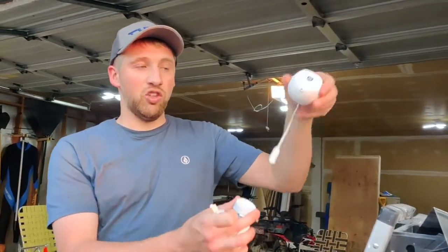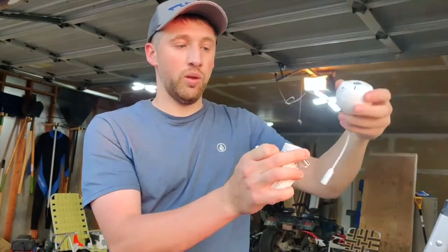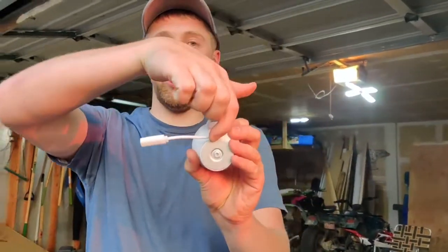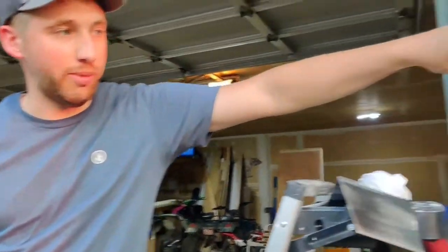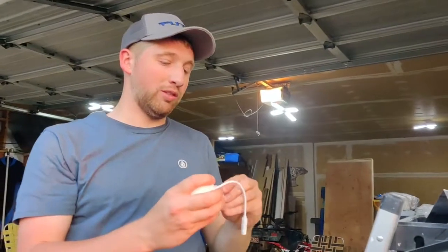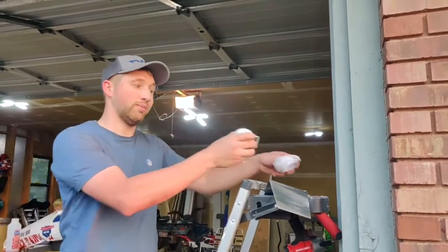The way this camera works for mounting it is that it's just magnetized — kind of a cool, easy-to-direct mounting position. This metal clip on the back side is for the wire to have a placement. The bracket just has a single screw that mounts into the wall, and then this magnetic piece just sticks to it. Super, super simple install. It has about a 20-ish foot cord, so you're going to have to drill a hole into your house to run the power wire — or in this case, into my garage. Then I'll just use some caulk to fill in that hole when I'm all done. I'm going to start by drilling my wire hole and then I'll mount this guy.